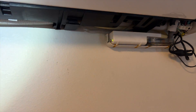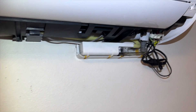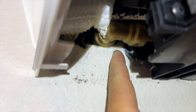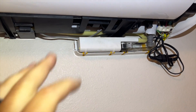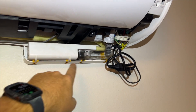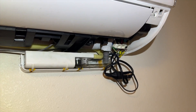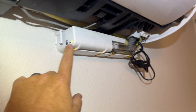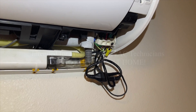We're back in the apartment at this mini-split. This particular one isn't leaking — that's not what they called for. There's no power and the thermostat's blank, but I am getting high voltage because this is blinking.